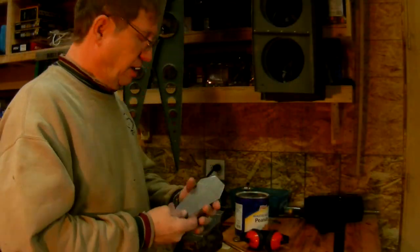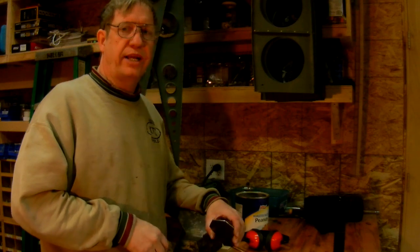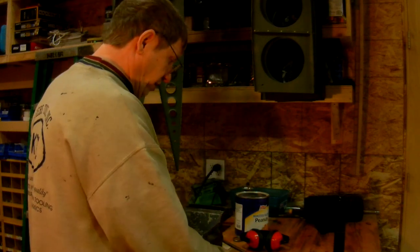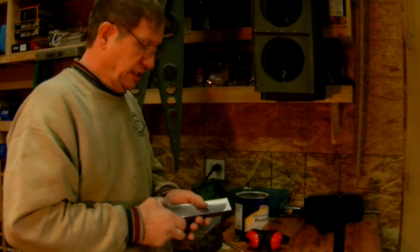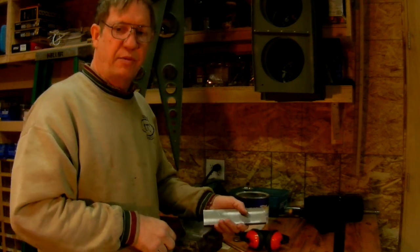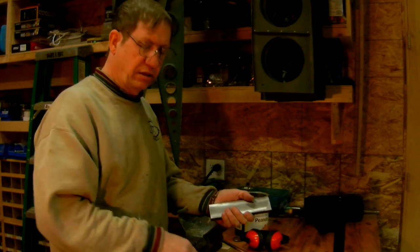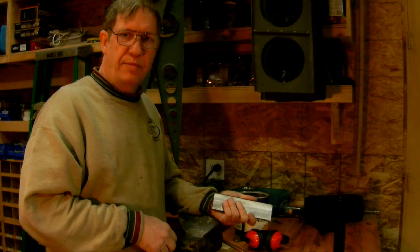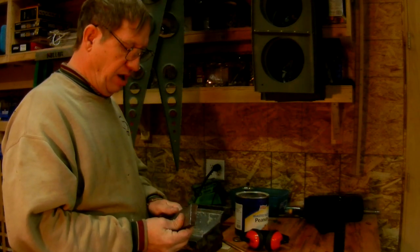I'm forming up the flap and the aileron support brackets. These are the ones for the rear spar. Since I don't have a press and I don't have a brake that could form steel about 72 thousandths, I'm using the hammer forming method — or the beat-it-to-death method. So I've got a forming block I made.